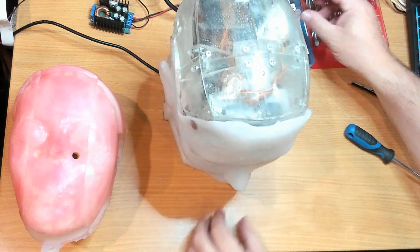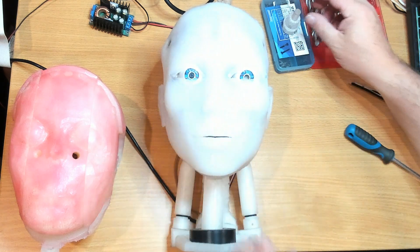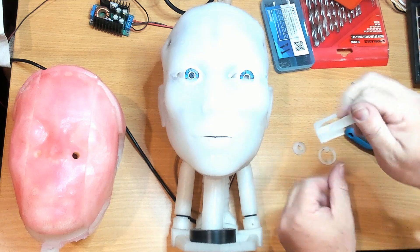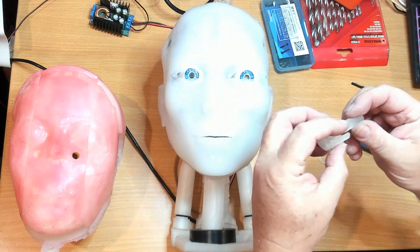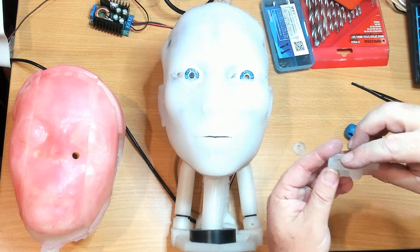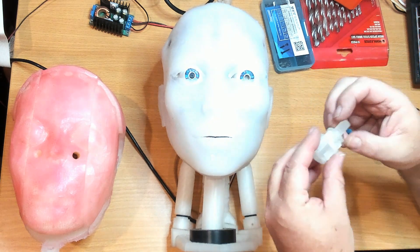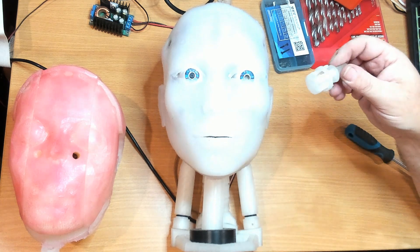If you're interested in how I got the eyeballs to look alright — it's a bit hard to tell in these images, but I thought those eyeballs came out quite well. This is the gadget — I reprinted this after I broke the last one. It's got a very similar catch mechanism to what's on the eyeball pivot assembly, so the eyeball will clip onto this. There's a little groove for the bottom. You can push this piece on and, with a couple of screws, make sure it's held in the right spot. This piece pushes in to keep those arms separated so it gets a good solid grip on the eyeball. Then you can mount that in your electric drill.